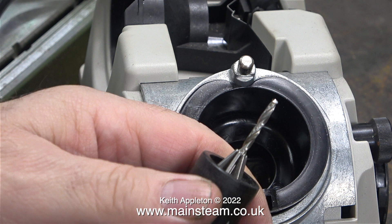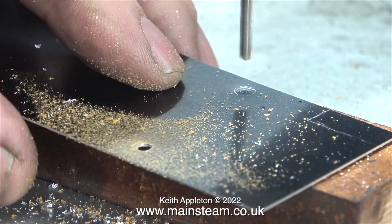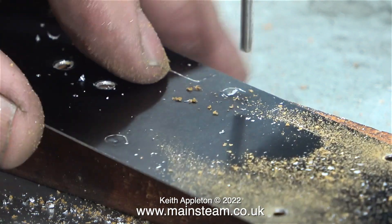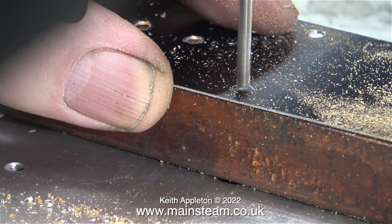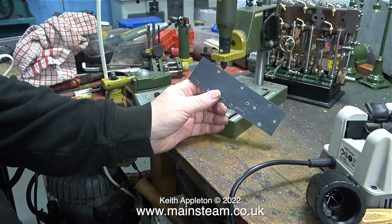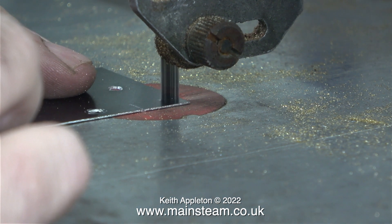With the 750X Drill Doctor you can also change the angle at which you grind the drill bit. Now I'm back at the drilling machine and I have to be very careful because it really is going to cut the aluminum. These holes will need to be a good bit bigger than the 3.1 millimeter pilot holes I'm drilling currently. You can see how I'm really having to control the aluminum. The main thing is that the hole is in between the ring I've drawn with the file — it doesn't have to be perfectly centered, as long as it stays within the constraints of the ring. I could of course use the milling machine, but removing double-sided tape would possibly distort this very thin, very weak metal.